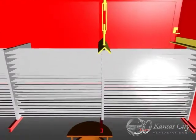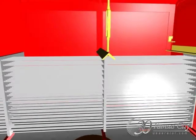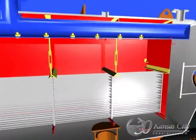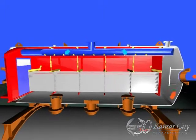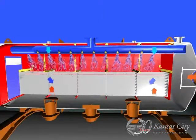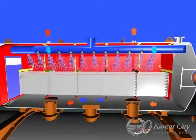A simple arrangement of threaded rod, angle iron, and retainers allows downward pressure to be applied, locking the trays into place. In the first stage of deaeration, water is fed through a distribution pipe to our spray valves designed to create a fine film and even distribution over the tray stack. Spray valve arrangement and quantity is critical to performance, and it's important to have an experienced engineer design the arrangement.